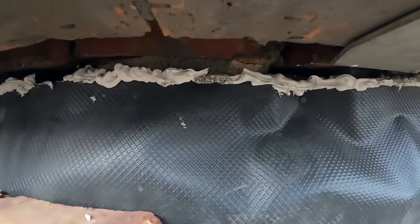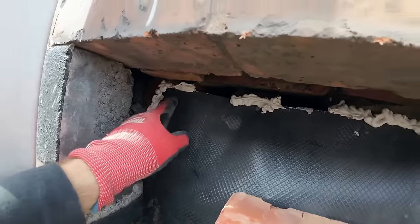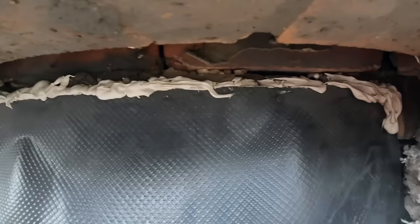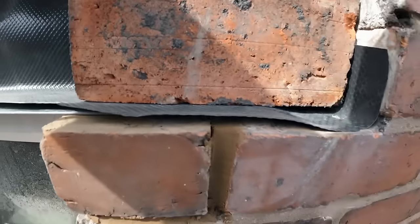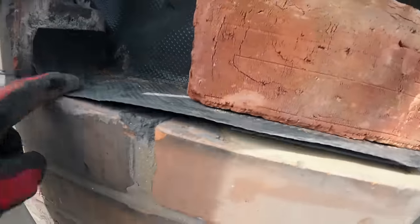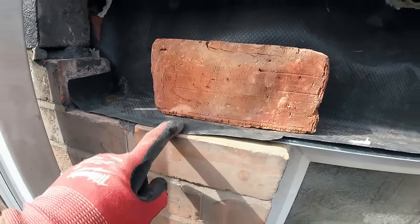It's not pretty, but it's all gobbed up with no nails. There's actually nothing there, no wall there or there. That's a joist nailed into that. This is stuck on the end, stuck along there, nailed onto another joist, so it's going nowhere. We've got way past our lintel, then our upstand goes past. Same again, lintel's there, we have to go to the next perp. If you went to the first perp, you wouldn't go past the lintel. You've got to go past the lintel.